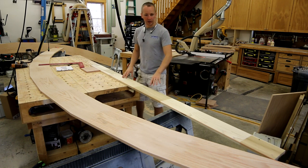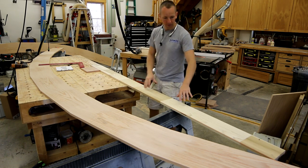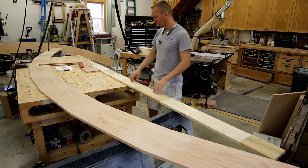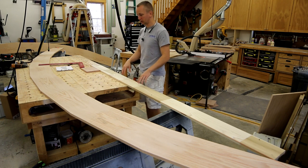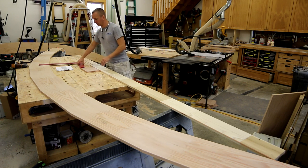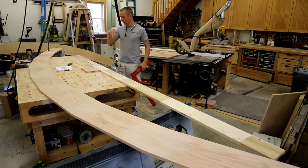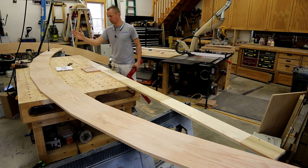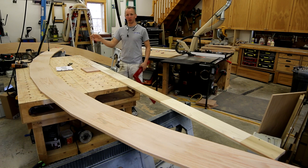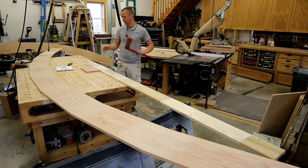Starting out, I've got the segmented arch up here and just one piece across the bottom. I went ahead and nailed that to the workbench to make sure it doesn't move. I've got my center point here, and I like to have a splice in the center with my segmented arch. That way I always know exactly where the center is of this arch — if I had one piece going across the center I wouldn't ever be able to tell very well.